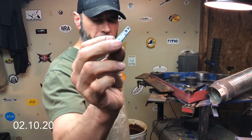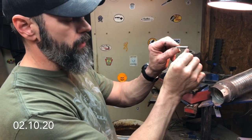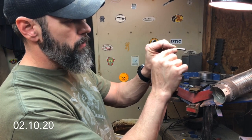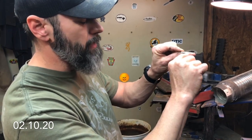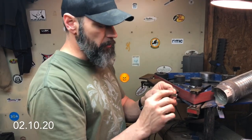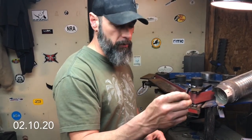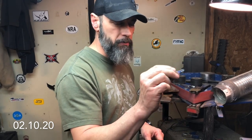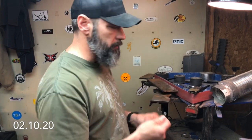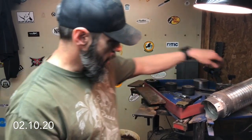Instead of being fully milled — milling it out and leaving an area down here thicker to catch on the pocket — it's going to be ground all the way down thin so that it can then be bent. Normally I would do this over on the mill, but I've only got one of these to do. The rest of them are getting completely bent clips. Since I've only got one to do, it's honestly easier just to hop over here on the grinder and do it by hand. I thought it might be interesting for you guys to see how I do that.